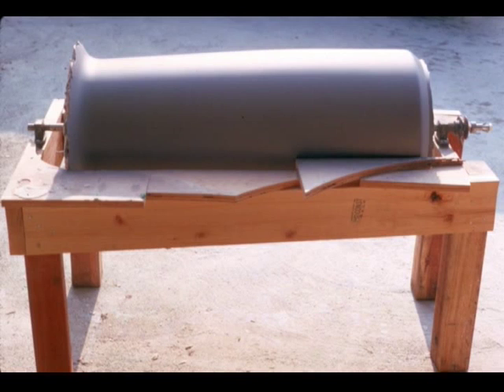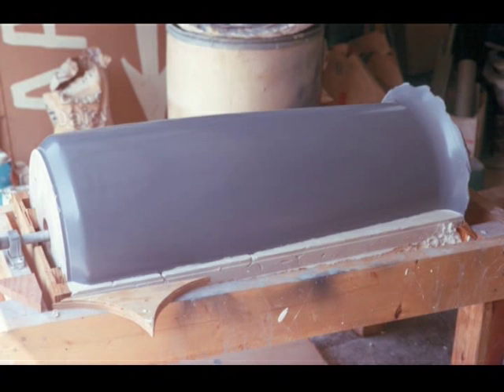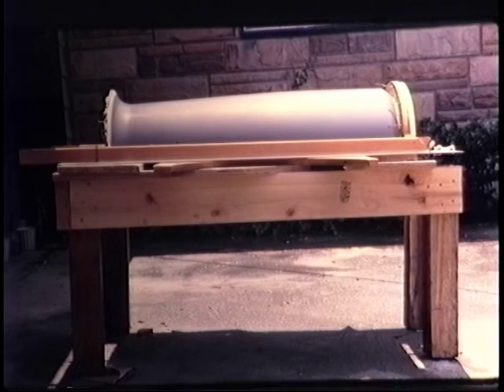This view shows the assembly basically completed, sanded, and polished out. It's ready to make the master tooling, which will be in plaster. This is the setup shown ready to take a cast off of the plaster. The ends of the plaster are located by putting in a small template where the tube will interface with the sphere.